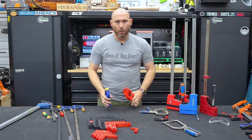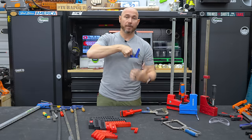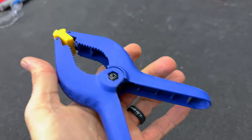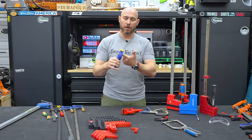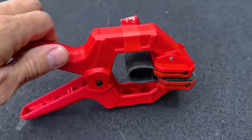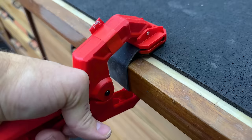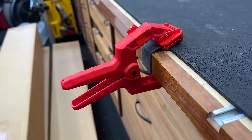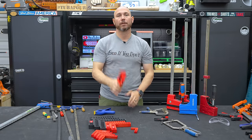Now for those squeeze clamps — depending on the type of work you're doing, look at these two. These little blue ones are handy as a shirt pocket. I use these all the time to hold things down while I get a measurement or just hold things in place until I get a bigger clamp on there. They have a jaw on the inside so you can clamp round stock and all kinds of stuff. There's also another version with a band attached — I love having these if you're putting on face trim or anything like that. This helps hold things nice and tight while the glue dries, or while you put some pin nails in.